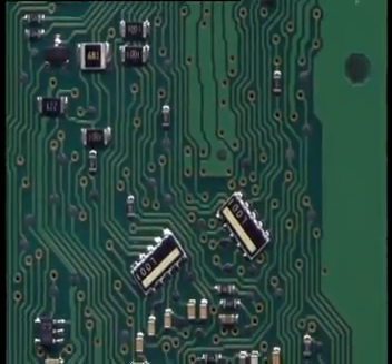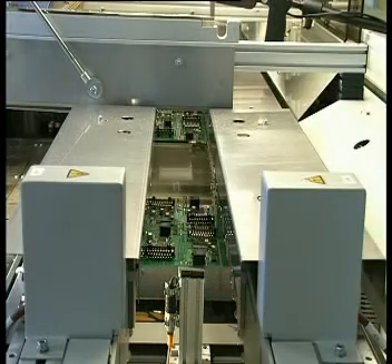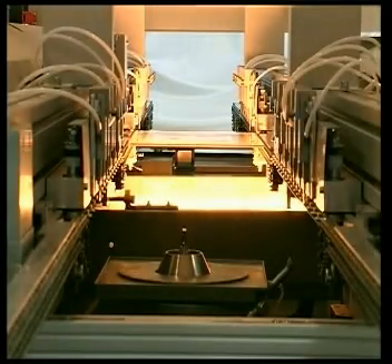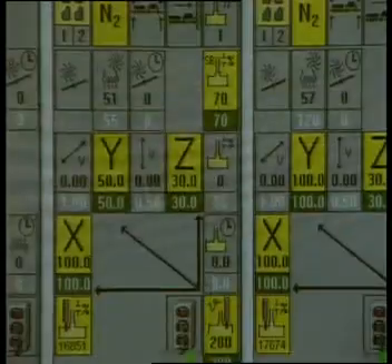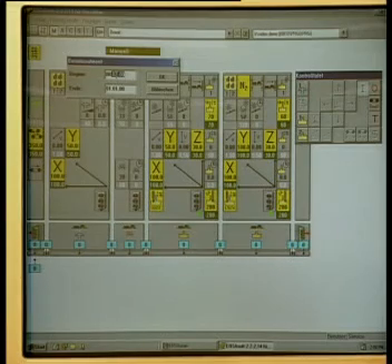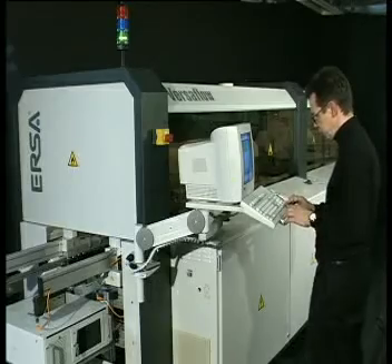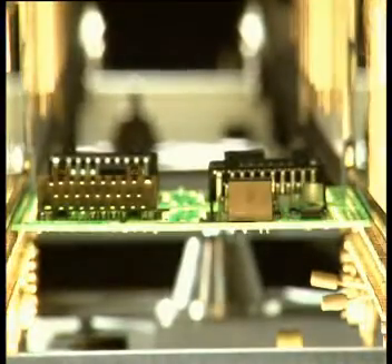The result is a highly clean circuit board with low ionic contamination. The pre-heat module utilises a short-wave IR quartz heater, protected with a clear ceramic glass cover for ease of maintenance. The output of the IR emitter is fully adjustable. The emitting temperature and heating duration can be programmed for each specific board assembly. Thermocouples continuously monitor the actual temperature and provide closed-loop thermal management, assuring adherence to the programmed set-point and preventing premature cool-down or overheating of the circuit board.